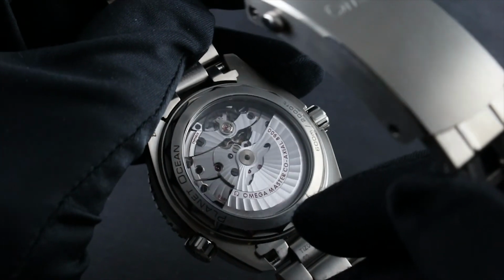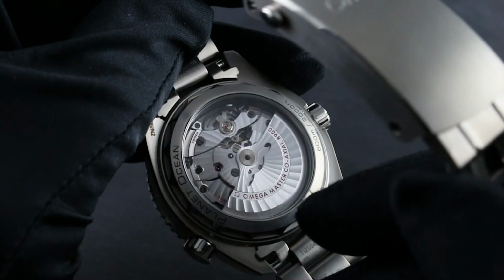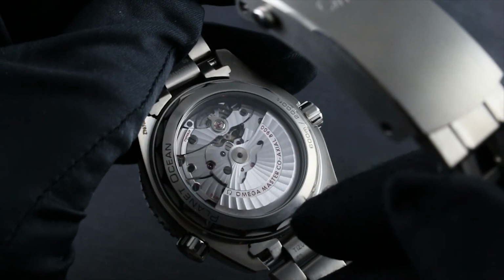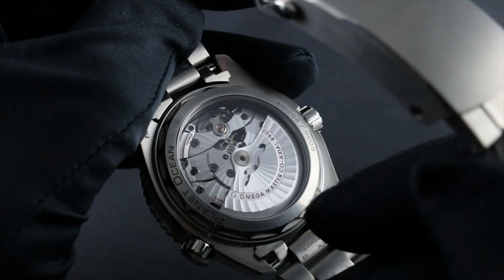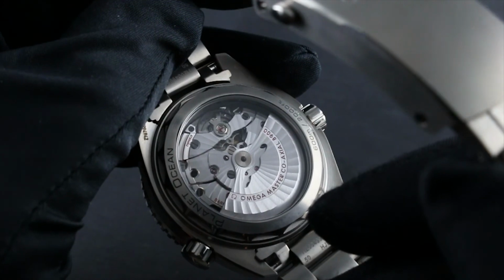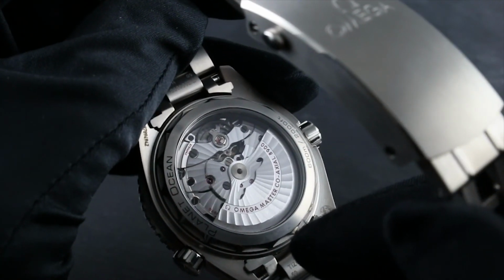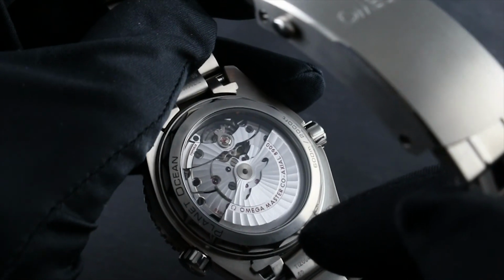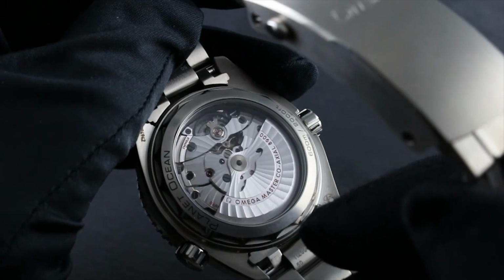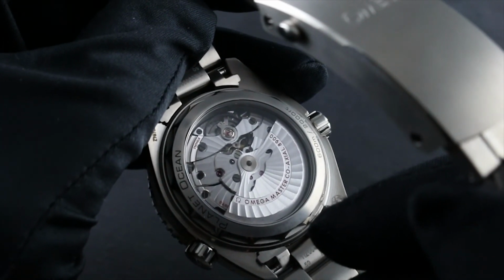Now, it's also important to note that because of the master chronometer standard, this is also an amagnetic timepiece, so robustly resistant to water down to 600 meters. It's also resistant to over 1.5 Tesla or over 15,000 Gauss, more an amagnetic watch than an anti-magnetic watch. The caliber features dual mainspring barrels coupled in series for even torque release throughout the entirety of the 60-hour power reserve, with smooth bi-directional winding so there's no rotor wobble or unseemly noise on the wrist.